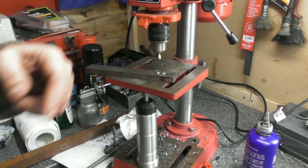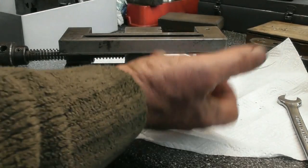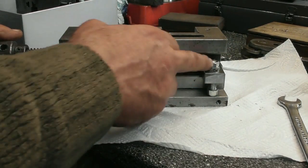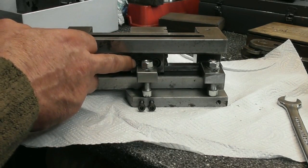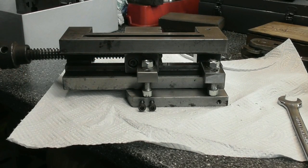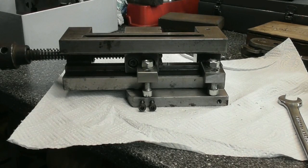So I'll chop it off now. Well, I think that ought to do it. A couple of little clamps, adjustable jacks so I can use them at different heights for other things. A shorter one here and the long one, clamps it down onto my what's-it, and this one's shorter so that it avoids the moving jaw retaining block. So yeah, I now have the means to clamp my vise directly to the saddle of the lathe.